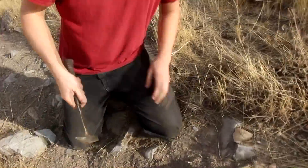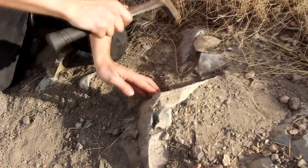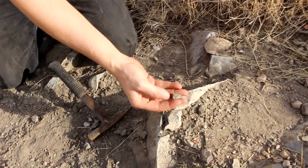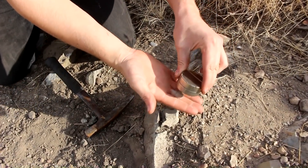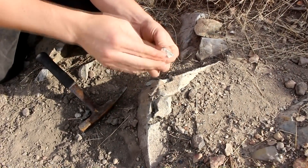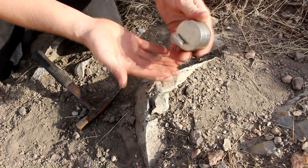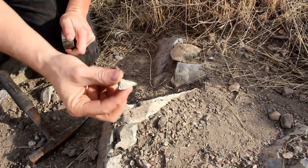Let's point down here. This is actually a fairly common rock in the area, but this is the only place I know where it outcrops. Let's break off a chunk of this — you can see it's white and a little bit gray. There's not any obvious reddish-brown coloring to it, but if you bring a magnet next to it, it sticks to a magnet. What you basically got is the white silica-rich rock with little specks of magnetite in it. Magnetite is, of course, black and very magnetic. So this rock right here will be our iron ore, which I'll try to extract iron from.